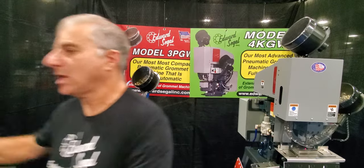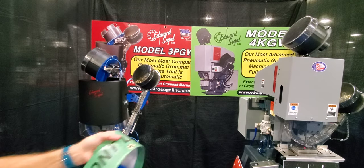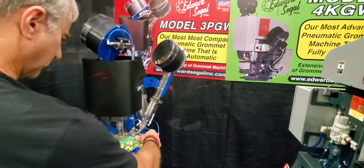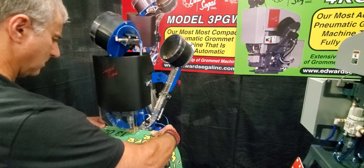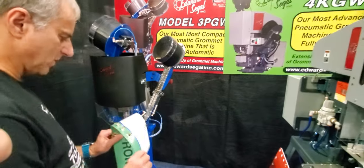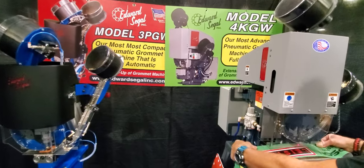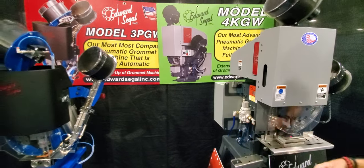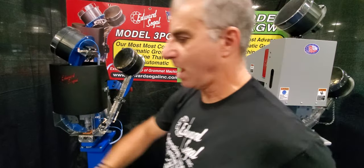Let's switch to the big machine. Look at that — all grommets fully suspended in the fold-over hem. By the way, I'm an outdoor event specialist — I specialize in decorating outdoor festivals and sporting events and use ball bungees, which means my banners are under tension. So it is very important to me that my grommets are fully suspended in my fold-over hem. Now let's run 13-ounce front lit on the 3PGW.